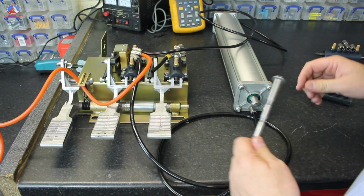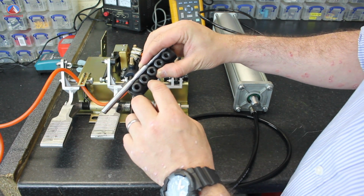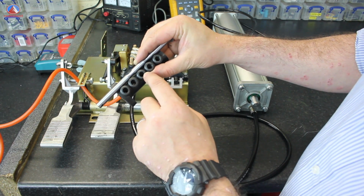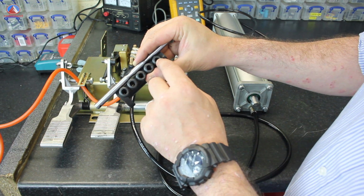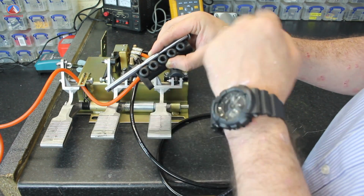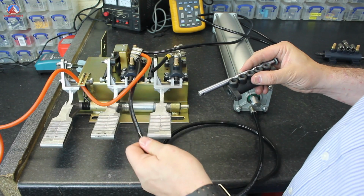So what happens is, as the pedal is pressed, this shuttle will move in and out, and it'll line up with 2 pairs. So 1 and 2 will be lined up, 3 and 4 will be lined up, nothing on 5, and then as you press the pedal, 2 and 3 will line up, 4 and 5 will line up, nothing on 1. So this is our supply, so the supply will go out to 2, and then the return 4 will exhaust out through 5. And then when it's in the opposite position, 3, that's the supply in, that orange pipe, will supply 4, that's out to that side of the ram, and then the return 2 will exhaust out through 1, because these pipes are both supply and return at different times. As the shuttle's in different positions, this will be the supply pipe and it'll be the return pipe.